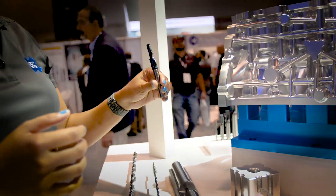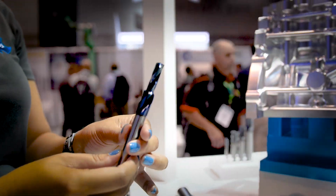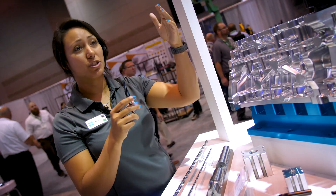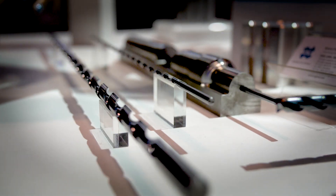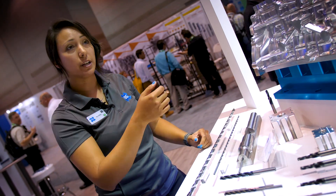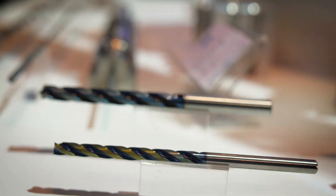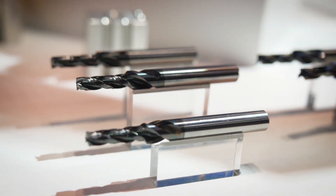Another portion of the automotive industry is that they drill millions and millions of holes, and a lot of them have to be tapped as well. The majority of the tools we sell to automotive manufacturers are specials — just like this ATRS step drill. Our standard ones come straight, but we do a lot of specials. One of the biggest ones you see here is a 60-times-D drill for drilling crankshaft oil holes, which is a big component of machining engines.